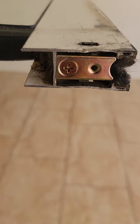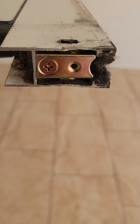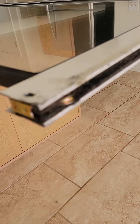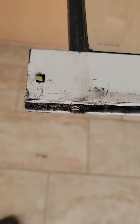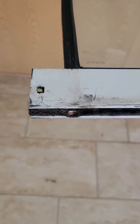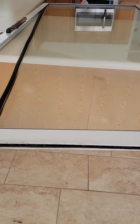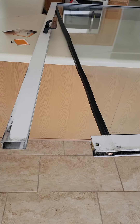I'm going to pull this frame piece back over and use this screw to put that frame piece in. The hole to the right is for the frame to attach, and to the left you see that screw — that's the screw you turn right or left to raise or lower the wheel in and out of the track so you can adjust the door. It's that simple. There are about a dozen varieties, but here's one example of a patio door roller replacement.